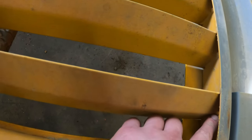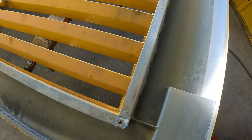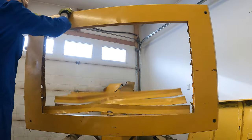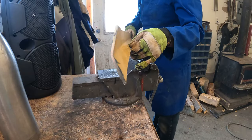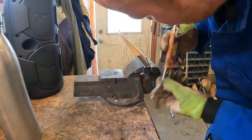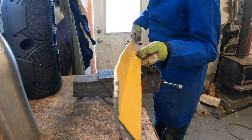I have to cut each one of these out. The weld is in a really crappy area, so what I'll do is probably just slice it there and weld it back in later on. Before I get too far ahead of myself I'm going to mark these out. First one's not too bad, just a slight bend. Second one a little bit worse. Third one not too bad. Fourth one just a little bit tweaked.